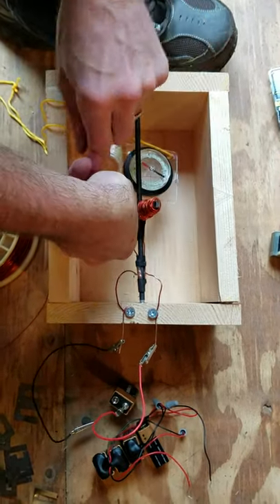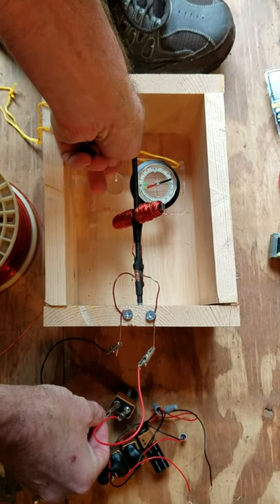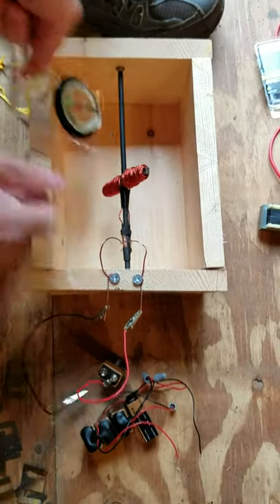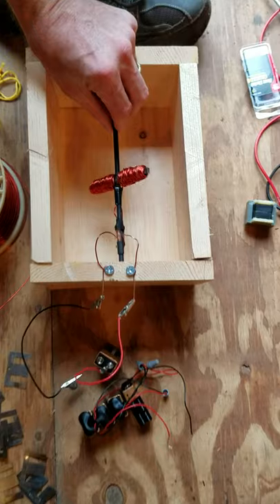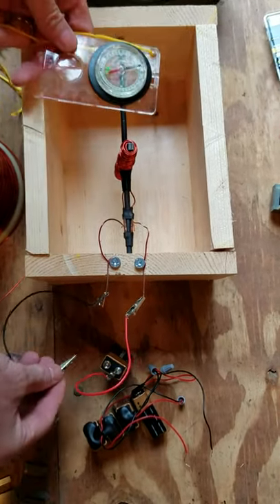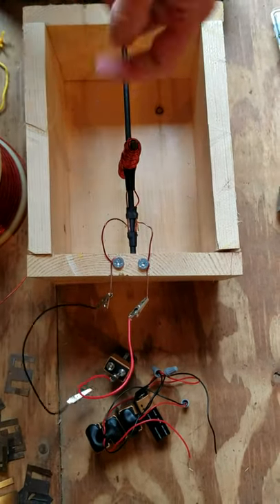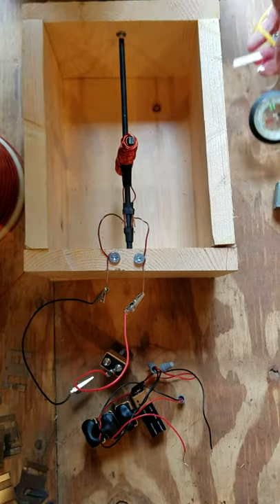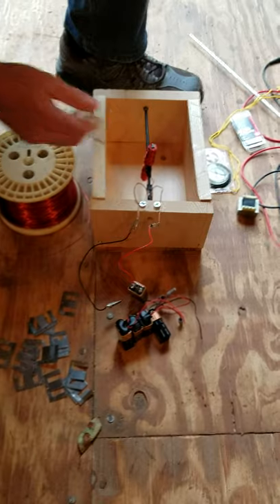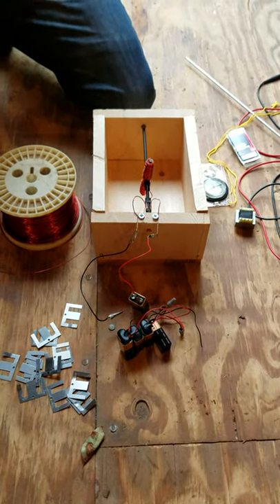If I put this down at the bottom, you'll see that the bottom is attracting the north needle. When I spin this, it was attracting the north needle a moment ago but will now attract the south needle, because every time it spins that pole switches — and that's what makes the motor work. Now that we've demonstrated Ampere's law, let's demonstrate how the motor works with a magnetic field inside.